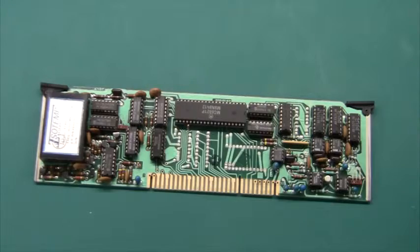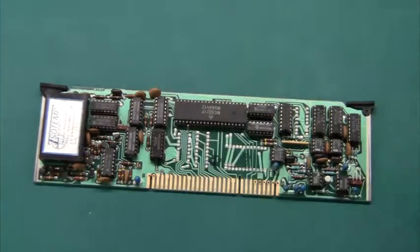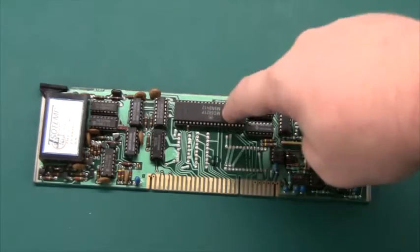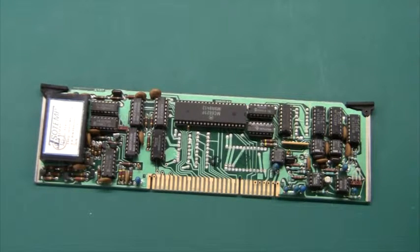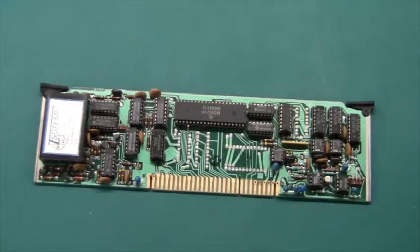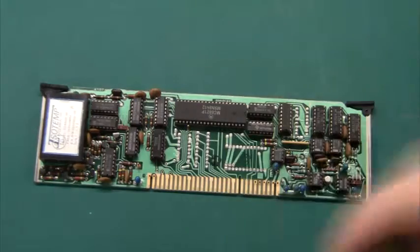This is the board I'm really interested in — it consists of three things. In the middle is the interface to the main CPU, which is on another board. This is basically the address and data bus from a Motorola 6809 that controls everything, connected via a parallel port chip. On the left is a temperature-controlled oscillator and some logic gates — I heard these are ECL, but from what I can see it says 74LS, so it's just normal TTL level ICs, which makes my life a little bit easier. On the right side there's some analog stuff with a lot of DACs. It should be pretty straightforward to upgrade this board from the basic counter module to one that can also measure power levels.